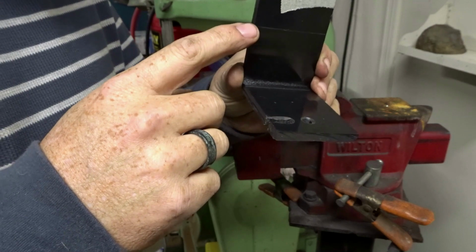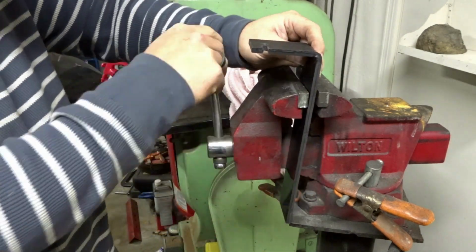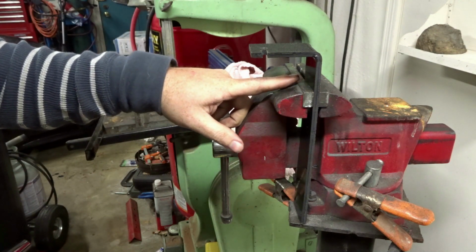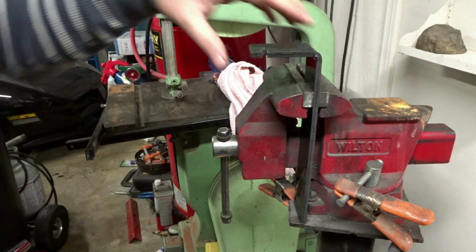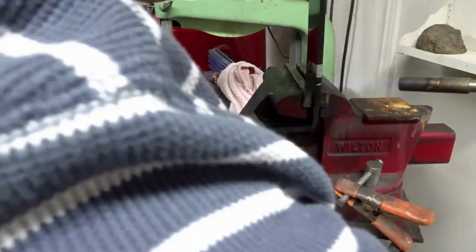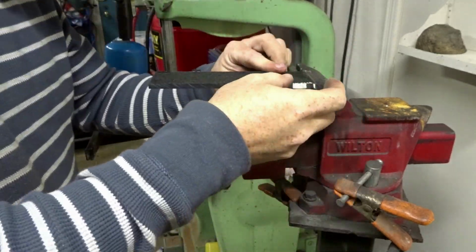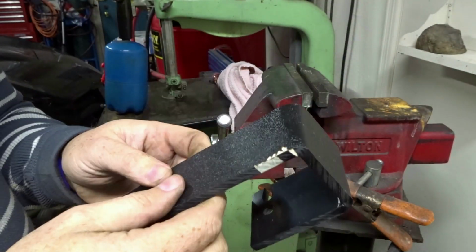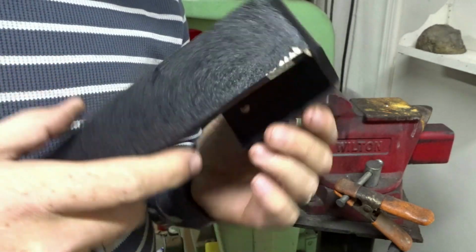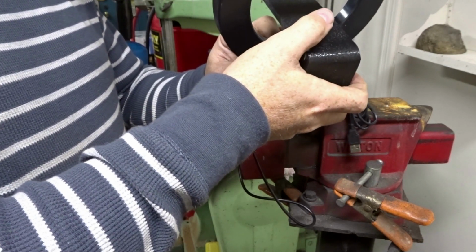Basically I just eyeballed it up to about where we need that other bend. I had to switch over to this vise because I have a little bit more depth in it. And heat this up. Now since I don't have as much leverage, see if I can flip that around, because I do want more leverage. Okay, so we got that pretty straight. Alright. I'm going to turn you off, grab that camera, and figure out exactly where I want to mount.